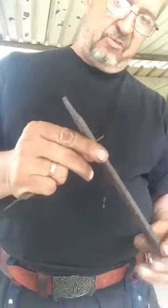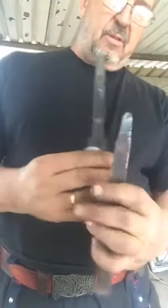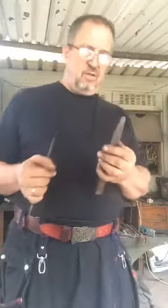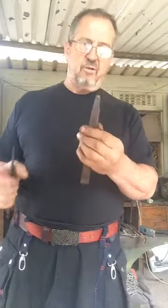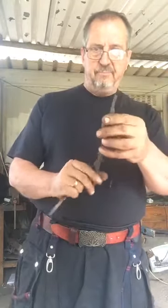Hello Jenny. So you need your blade, and then I use any old punch. I've got a whole lot of these lying around. This is a piece of scrap 5160 I've shaped to basically mirror the tang. It's the same thickness and it tapers. I'm going to use that to hot punch through. You can harden that and temper it, but I just use them so often, I'll just make one as I need it. This one I've had a while, so I'm just going to dress the face just now and make sure it's going to work properly.